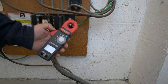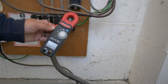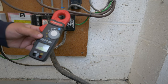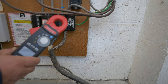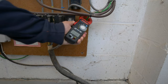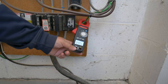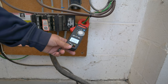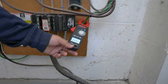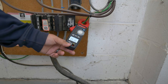There are a few things you can use to monitor for circulating currents within the earthing system. One is a clamp meter — in this case the TIS 570 AC DC leakage clamp — which will check for any AC and DC currents that may be flowing within the earthing system or other conductors. If I pop this around the main earth terminal and turn the backlight on, you can see we've got about 50 milliamps of current flowing within the earthing conductor, and I would anticipate that's about right based on the consumption in our own unit and neighbouring units.